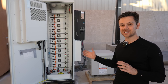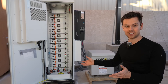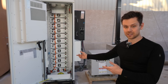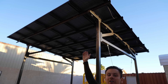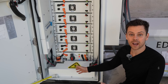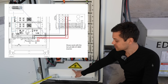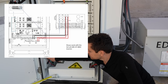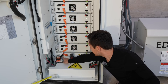Fast forward a week later and the system is running. Because this is high voltage DC, I turned off the camera so I could focus — you cannot make a mistake setting up a system like this. The solar string is almost 1,000 volts DC using 24 panels in series. Wiring up the battery was straightforward but must be done in the right order. Under this cover is 600 volts DC, and this side is 240-volt single-phase AC.